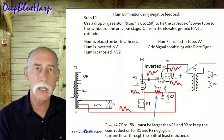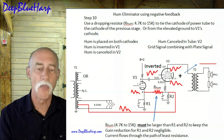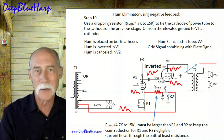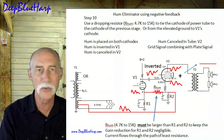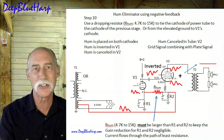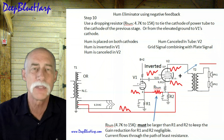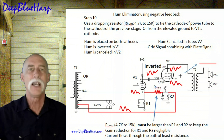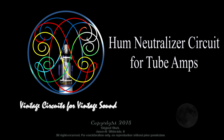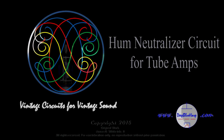That's what I did to eliminate hum in this tube amp circuit — by giving feedback from the power tube cathode to the preceding stage cathode, which goes to the grid, to the plate, which inverts it, feeds it to the grid of the power tube, feeds it to the plate, cancels out, and you get nothing out the back side. The amp went from 90 dB with hum to 90 dB with no hum. Happy listening — I hope this works for you. Thanks for watching.